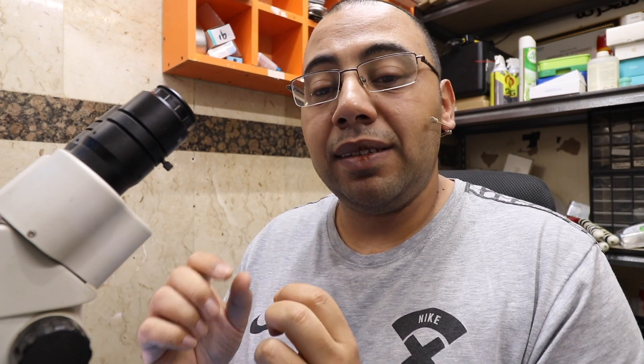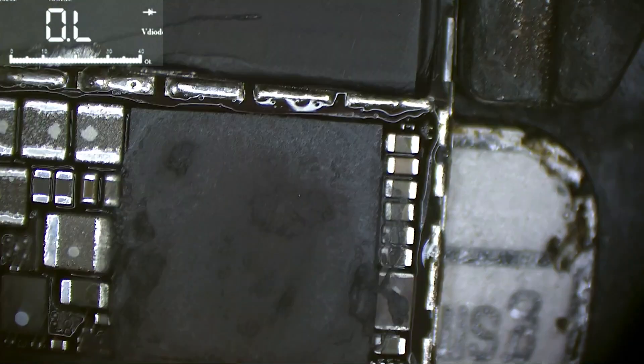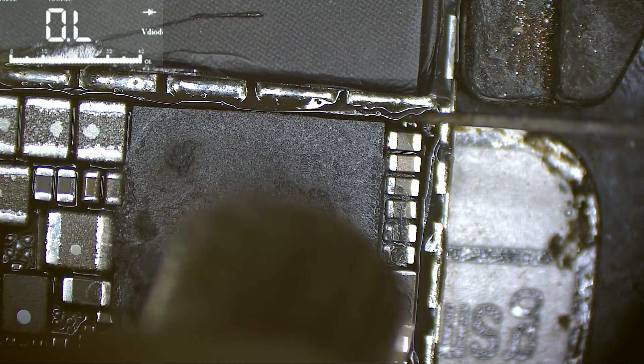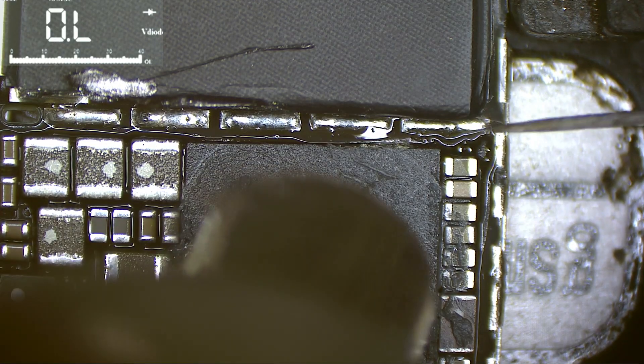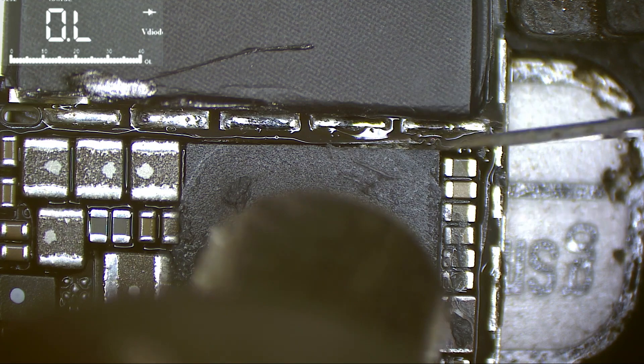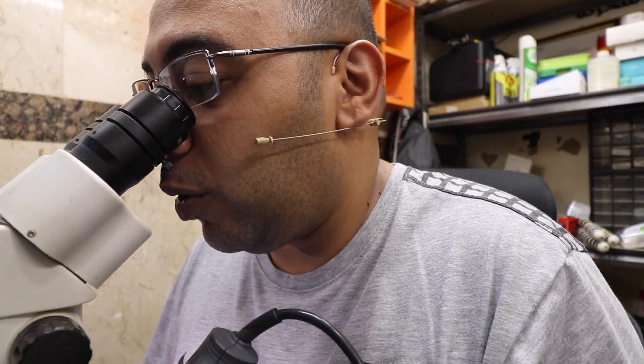This makes me feel like the balls under the baseband got connected together. So let's remove the baseband chip. If the baseband chip is the one causing the short, we will not find a short on the PCB after removing it. Protect your CPU with a heatsink, then remove the underfill with low temperature — 200°C. Take care not to scratch the board.